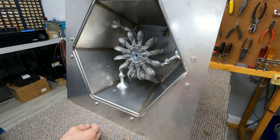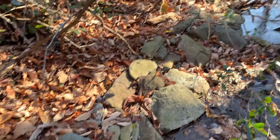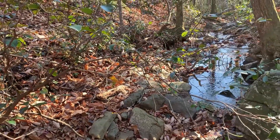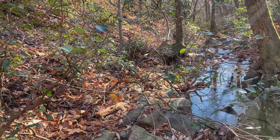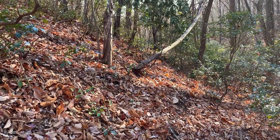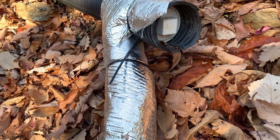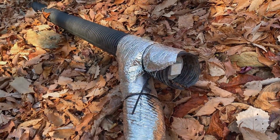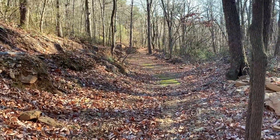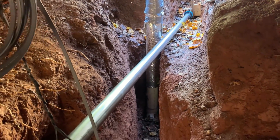All we need to do is calculate what kind of power we have available at the property. We will begin by measuring the length of our water line. It measured 120 feet from here at the intake to where the valve is. There are 50 feet from here to where the 2 inch union is. Here is the transition where the water line switches from 3 inch PVC to 2 inch HDPE line, and from here it heads down to the house — exactly 3,000 feet. This last coupler switches from HDPE to stainless steel, and this last section is 9 feet long.